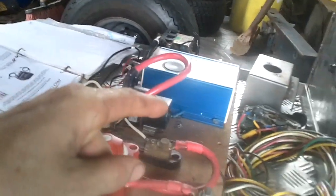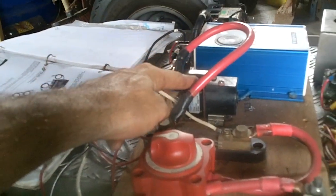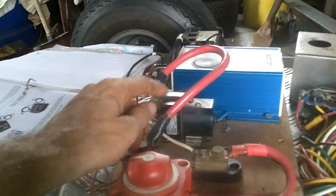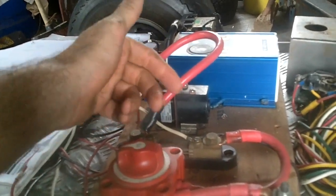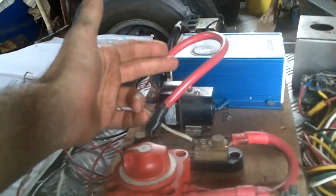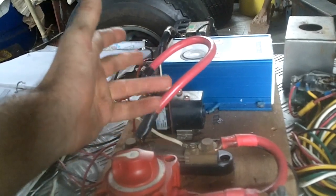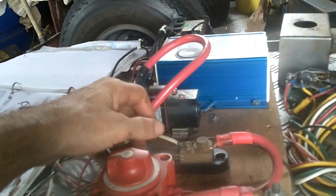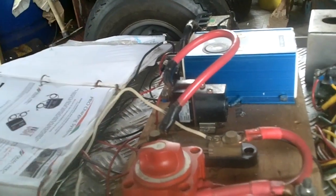I've got stuff here that can work, so let me figure out how to make it work. The only real issue I have with just getting basic function is this solenoid, which runs on 12 volts, and I will have no 12 volt power supply, only 24. But that means I should be able to check the resistance on the electromagnet part inside this, find a resistor that equals that to take up half of the voltage, and then it should work on 24 volts. Of course, the resistance inside is going to change once electricity is flowing through it, but it should have enough wiggle room that I should be able to get away with fudging it a little bit and making an estimation.